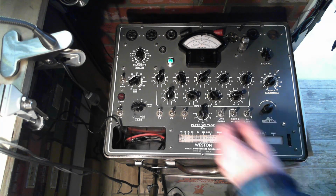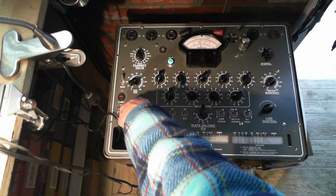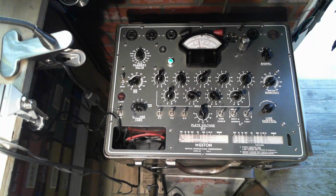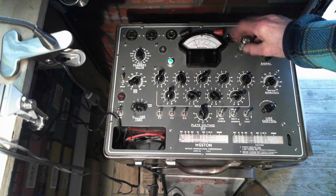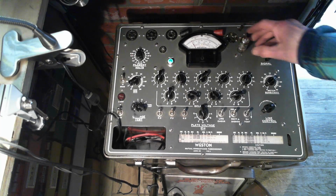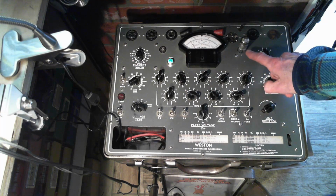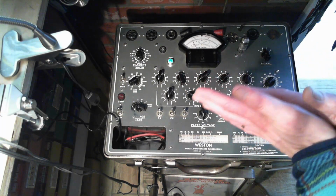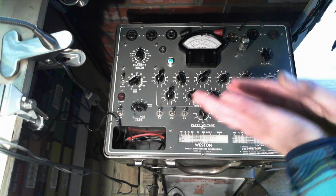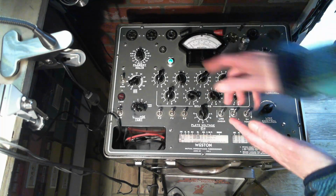That does not bode well. Let's go. There we go. Any shorts in this tube? Oh my gosh, there is. What's it doing there? It's jumping around. Jumping all over the place. So if what's happening is the elements in here have somehow shifted and are touching now a little bit, as the tube heats up, you could imagine it would become a shaky connection like that.